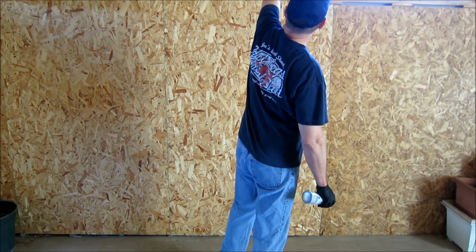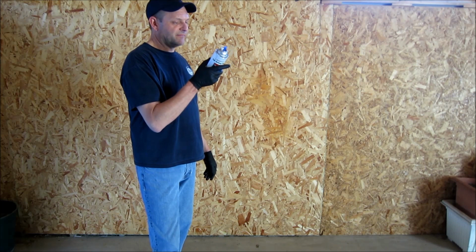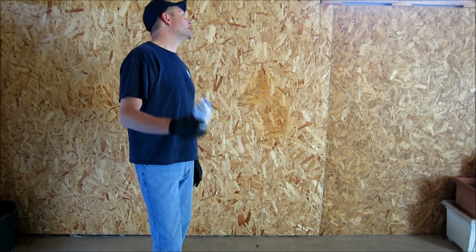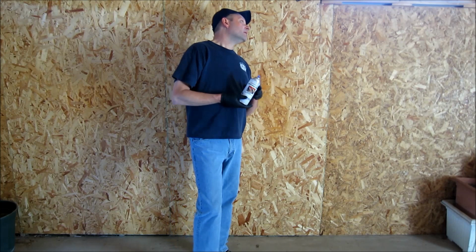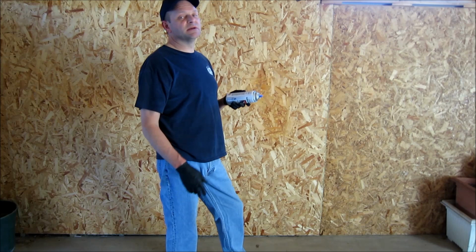Probably one more coat. This stuff is 2 to 3 thin coats. After you're done with it, it's a 30 minute dry time before you can sand it. But I'm not really worried about texture on some bracket like this that's going to be part of his rig, I believe. I'm not worried about some super microfine finish here, so I'm not going to sand this etch coat at all.